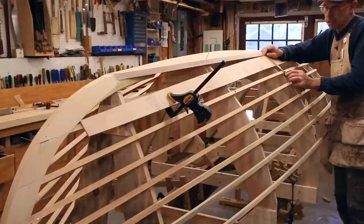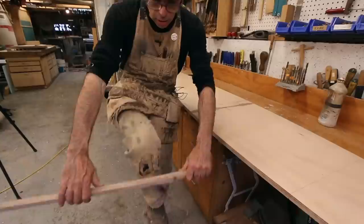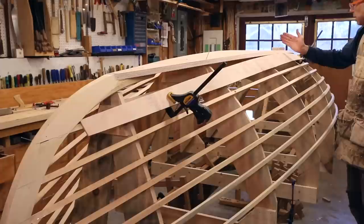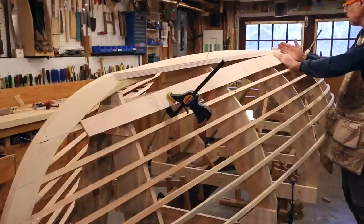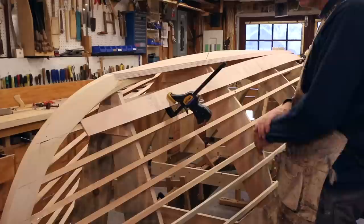You know, traditionally in boat building, we don't want to place scarfs in the same location, or butts in the same location. But my experiments with glued scarf joints are that they're so strong, I don't see why you can't. My bottom scarf right here, my garboard's going to be scarfed here. I think I'm going to juggle this out so that the next scarf just dances to this side of this line. We'll worry about the next one down. Maybe I'll shift those scarfs down towards the ends on the next plank. But for this particular one, I think we're just going to shove it over a little bit because it's more convenient. I don't really feel like trying to scarf up in these areas, especially back there, because there's just so much more twist in it. So scarfing in areas without twist is definitely the better way to go.